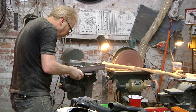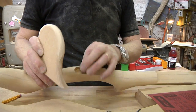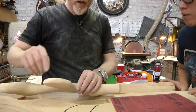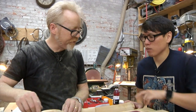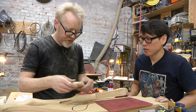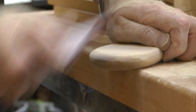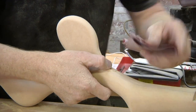So for this little eye on top, I've cut out a rough shape that'll slot right into this slot I machined with a 3/4 inch end mill. Now I'm going to sand this so it's a little bit flush. Then I'm going to cut out the middle eye, and then I'm going to glue it in. What do you use to cut out the middle eye? Probably the jigsaw, but we'll see. A lot of sanding from the inside out. I may not make it a perfectly rounded hole. I may make that hole have sharper edges because I think that could look kind of cool.